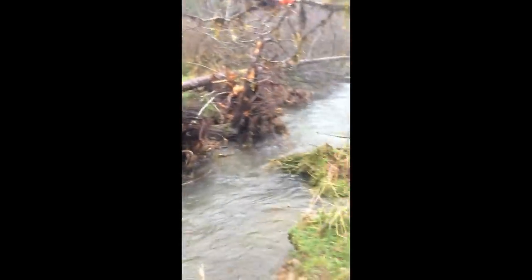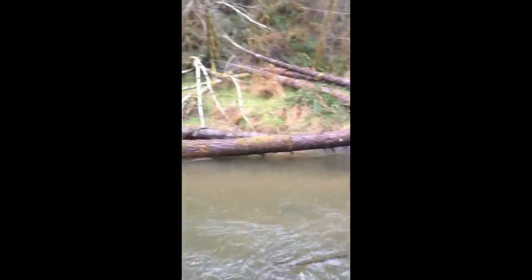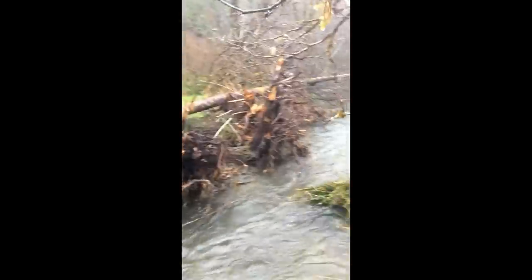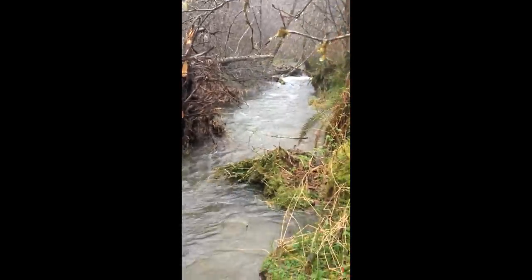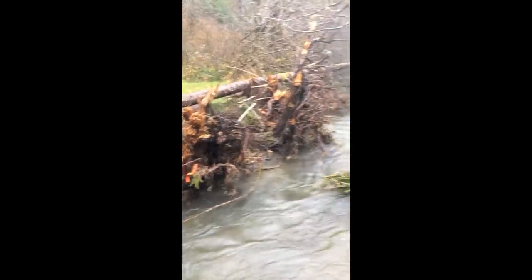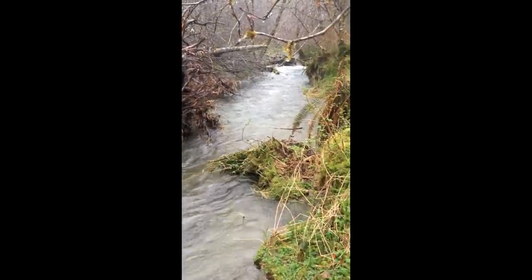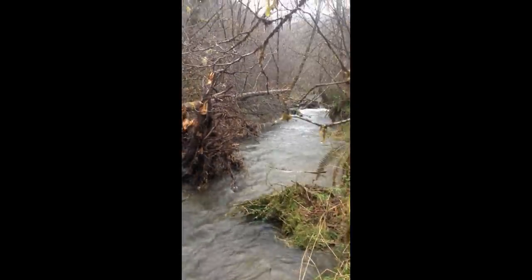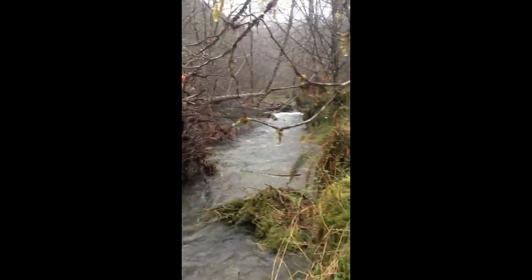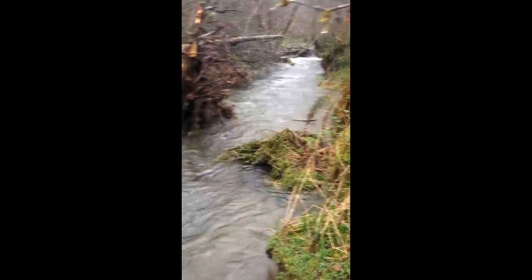I wanted to show you these logs. This is the downstream one that we designed with the help of Forest Service biologists Justin Gerding and Jack Sleeper. The idea here was that you'd create some backwater behind it at high water. You can see that flow is really ripping through that stretch there. Those roots sticking into the channel would somewhat confine the flow against this bank and actually cause some bank erosion, which is what we wanted — so that even as you impound some sediment upstream of some of these log dams, through the bank erosion you liberate a source of sediment for the downstream reach.